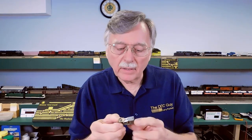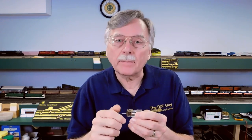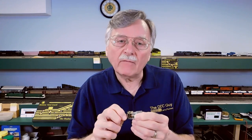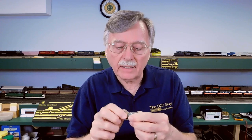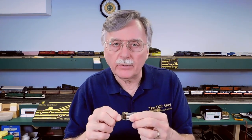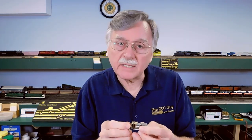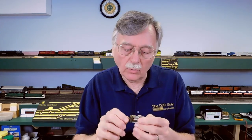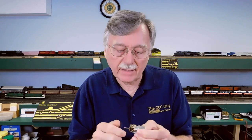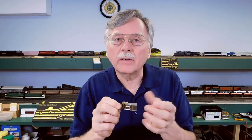Let me go into a little more depth on stalls. You can have that slipping current draw when it's fully slipping and pulling a large amperage. Then you can have what's called the locked rotor — that's when the motor is totally locked up and not turning at all. In that condition, it can draw an even larger amperage. Some decoders can take one to one and a half amps continuous and two amps peak or even more. You want something where your decoder's current capacity is going to be greater than what the motor is pulling when locked.